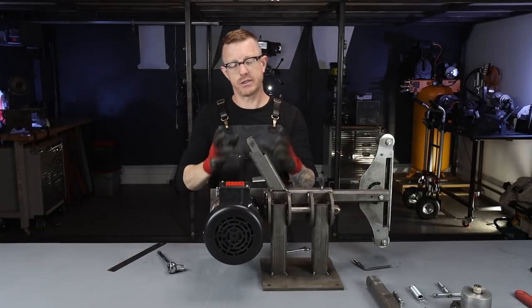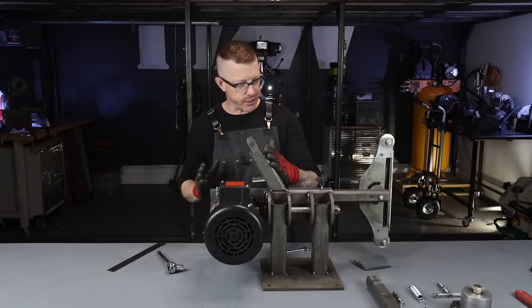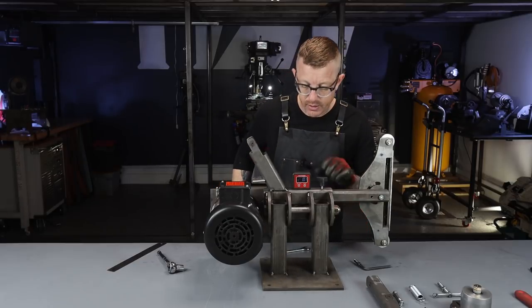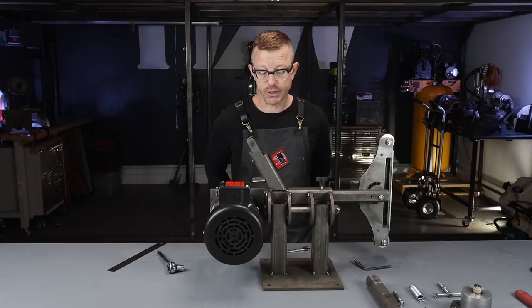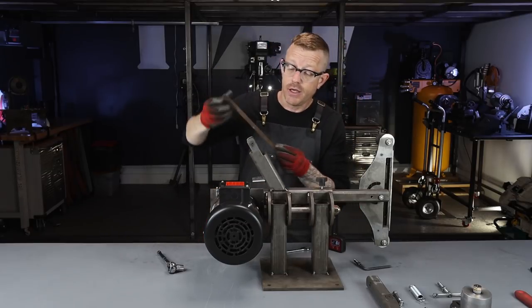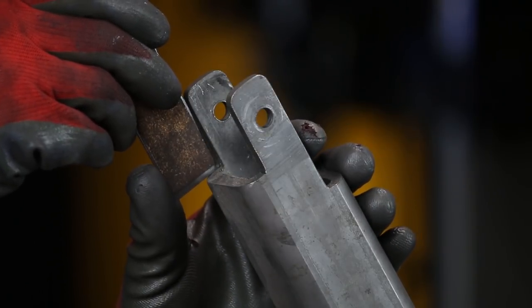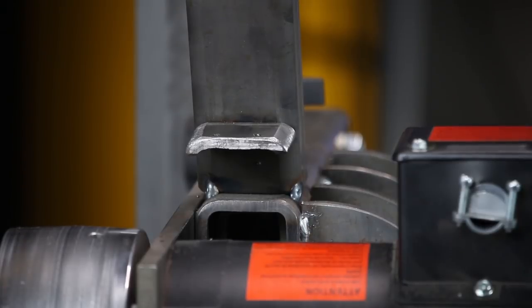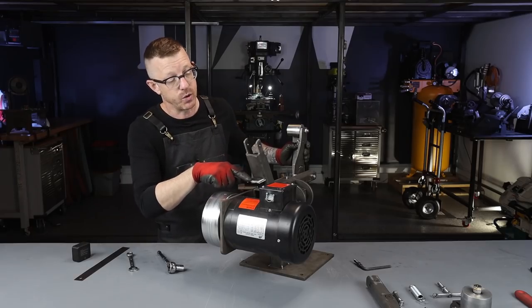Let's talk a little bit about the tensioning pillar. The tensioning pillar is a two-inch by two-inch piece of 0.25 wall tube steel. It is at a 60-degree angle from the receiver tubes. When I put it up on the wall to check — we're at 59.82 degrees, which is pretty close to 60. It's eight inches long. The drop-down here is two and a half inches, though I think you could get away with two and a quarter on that top notch. The back notch is one and a half inches, and this is pretty much perfect. The cutoff from this piece I just used down here to create the spring tensioner bracket — a simple piece of steel that's welded in so it sits level with the base with a hole in it to hold the spring.